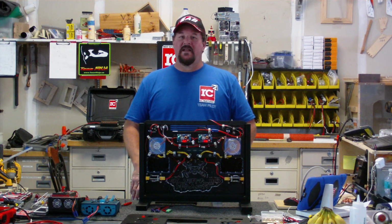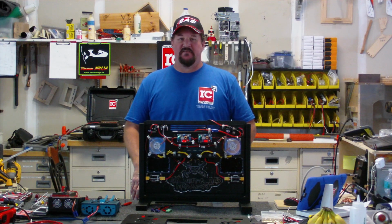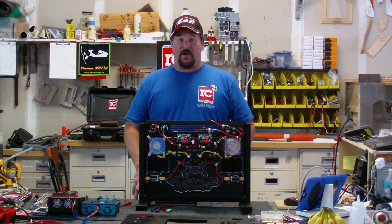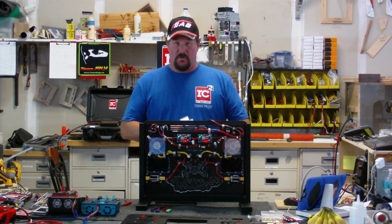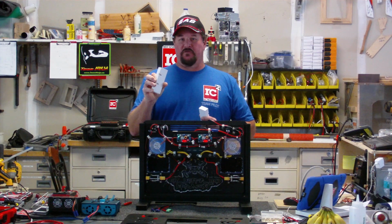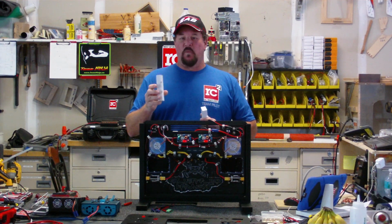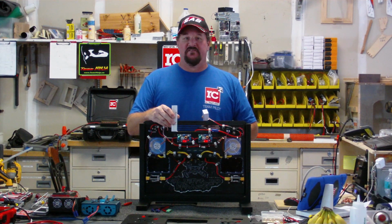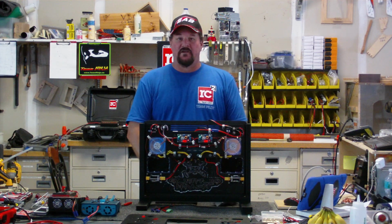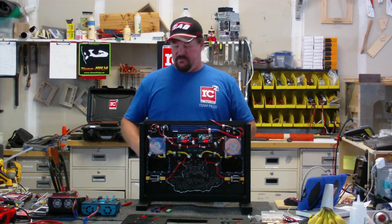Because our decks are made out of 1/2-inch structural PVC, it gives us the ability to do mounting unlike any other company in the industry. We make special custom blocks. We use pocket screws on these. Then we use a plasti weld that welds this PVC to the other piece of PVC on the deck. That makes it one strong, rigid piece.